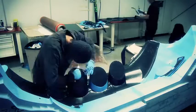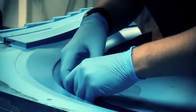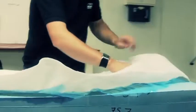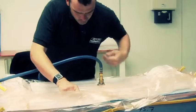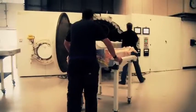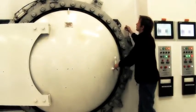The next stage of the process is to apply a thin layer of carbon fibre into the contours of the mould. Then the mould and the carbon fibre are put inside a vacuum bag, which is then compressed to ensure that there is no air between the two. Finally, it's put into an autoclave — basically a pressure cooker — and heated to around 100 degrees Celsius.